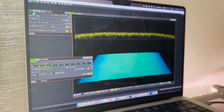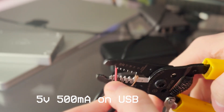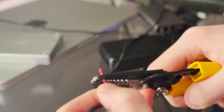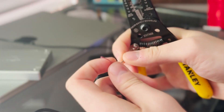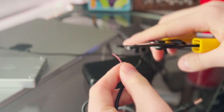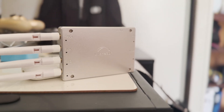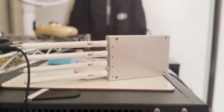I actually had to build a little power cable that will supply 5 volts to these things so that I can power it with my MacBook instead of having to carry the actual power adapter. The downside is that the MacBook is only going to be providing 500 mA instead of the 1 amp that the power supply it came with provides. I don't necessarily think that's an issue, but it may make it a little weaker.